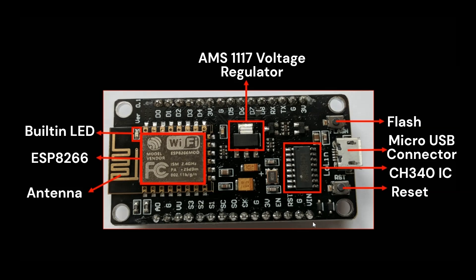So we have now covered all the input/output pins. To recap: D0 to D8 are the digital input/output pins; A0 is the analog input pin only — it cannot provide analog output; VIN is the 5 volt input pin; EN is the enable pin for the voltage regulator; RST resets the program on the board; G is the ground pin; the 3V pin provides 3.3 volt output to power external components; and TX and RX are used for UART serial communication with other devices.